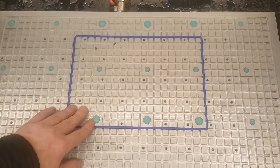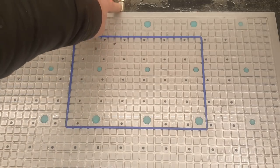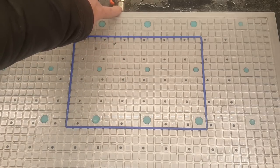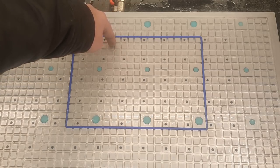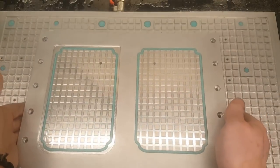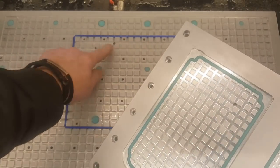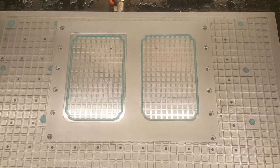So here I have my vacuum plate, and the vacuum port is here, connected to the hose. So there is no second bottom or anything. It's just the hole drilled through to here, and then another to connect the horizontal hole with the vertical. My fixture goes onto that, and the air goes from here through there to the vacuum. Ta-da! Looks pretty freaking cool.